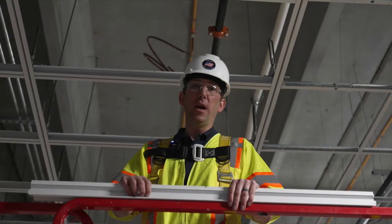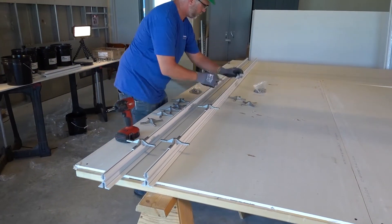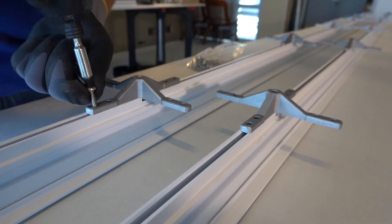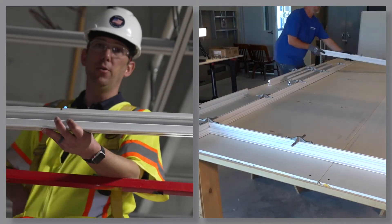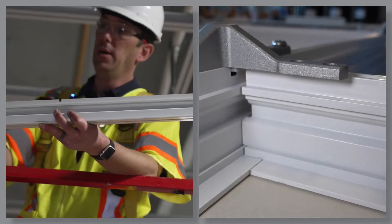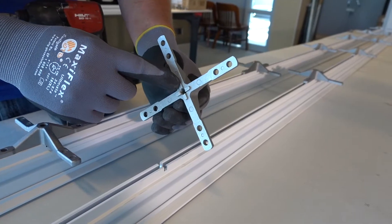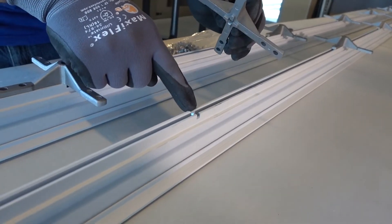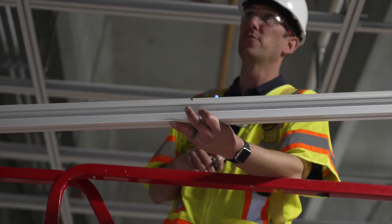That's right. So you might be asking, how easy is it to install this Dynamax? It's very easy. On this project, the installing contractor went ahead and built ladders on a table ahead of time while guys were installing as they were moving south within the data center. The ease and benefit of this Dynamax system is you've got these notches every two feet on center — these are cut in the factory and sent out, so you don't need to worry about measuring or cutting those on the job site. And then you've got your X bracket here. We also have a T bracket or a 180 bracket as well. The nubs on the inside of that bracket fit right into the channel of the Dynamax, ensuring it's always square regardless of how it's built together — you cannot be out of square with this product.